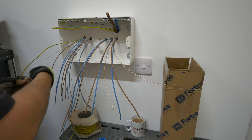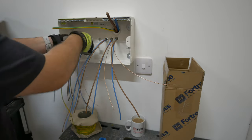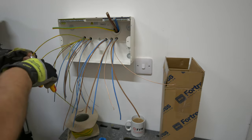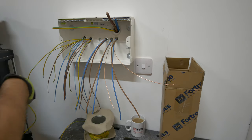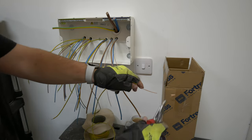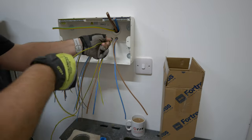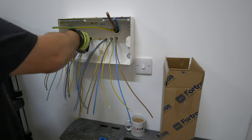I'm then going to go along this board. I've stripped all the outer insulation and just popped the CPC sleeving on. That's just to prep everything so all of the insulation and sleeving is in place ready to start dressing the board. You can see I've got my tails through the back of the board as well ready. I've used the grommet strip around that opening, however the hole in the wall behind that is actually smaller than the opening into the board, so technically speaking it wasn't really necessary but good practice to fit it anyway. These intumescent grommets I've used on the rear entry of this board are for a purpose - this is a cavity wall with timber inside and the potential for fire to propagate into the building if those aren't in place.